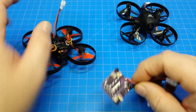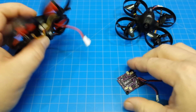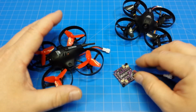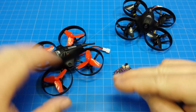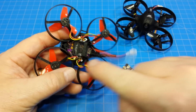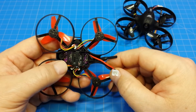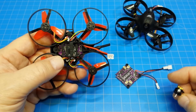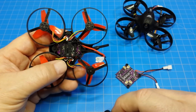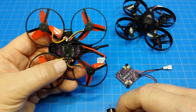You can still do the same things as far as power for your canopy. In my particular case, because we now have an OSD, what I did was I put wiring harnesses on the camera and VTX side and on the power side so that I could split everything up and connect them, then disconnect the canopy when I wanted to or if I needed to swap it out. You can see my receiver right here at the bottom. I think one of the things I need to show you is flight performance. Now this could be some sort of placebo effect or confirmation bias, but the combination of these new motors and the new ESCs that support DSHOT 600 on the flight controller make a substantial difference in how these things fly. Let's take a look.